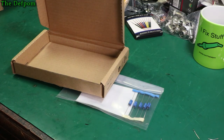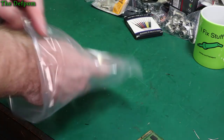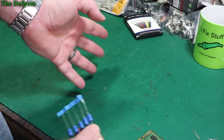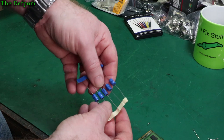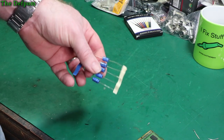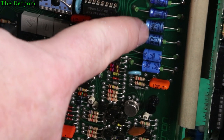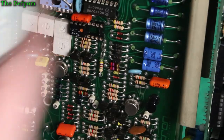At least these are the ones I've been waiting for, and I need four of them so I've got one spare. These are 33 microfarad. These are for the Datron. I've got two Datron 1061s - the LS101 and the other one - and they both need all the caps replacing. All the other caps are in stock, I just don't have any 33s. So 33 microfarad, rated at 40 volts. I thought it was high voltage in that - that might be a problem. But this is what's in here already: 33 microfarad, 40 volt. So it's the same spec, basically. So that's all right.